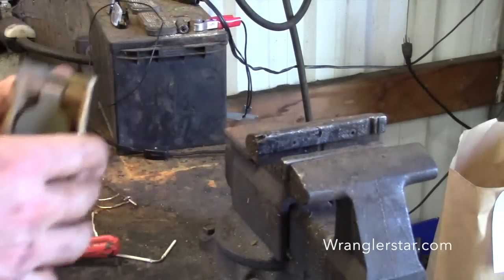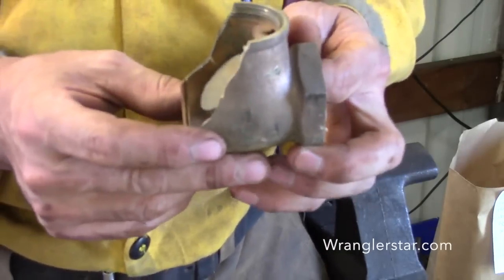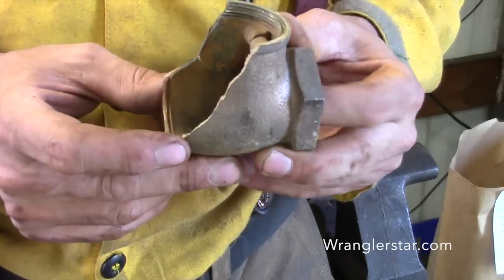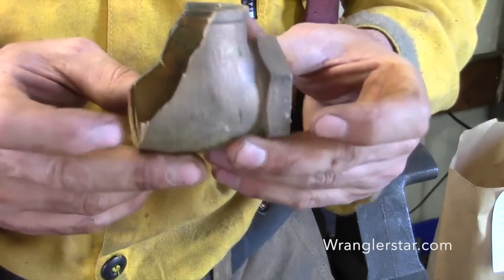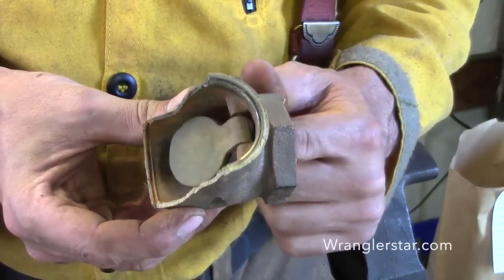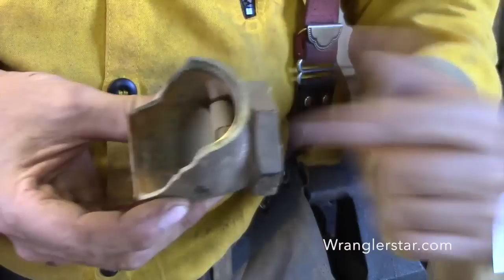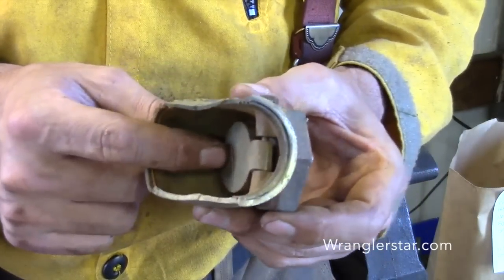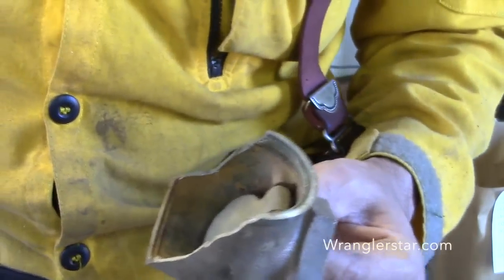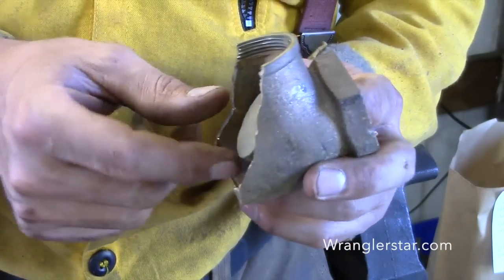This being all broken apart is a good teacher's aid. A swing check valve — I told you there are two moving parts in a ram pump, and those two parts are called swing checks. What a swing check valve does is it only allows water to go one way. Think of it like a dog door: water comes through, pushes the door open, and then after it's through, it slams shut. The dog can't get back out — that's a one-way valve, that's a check valve.